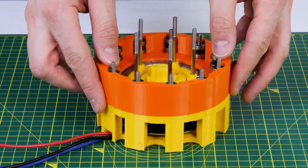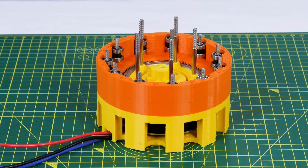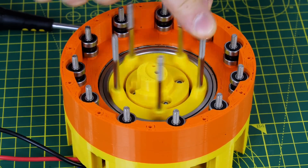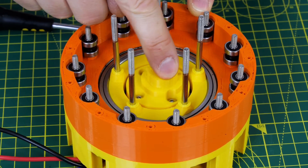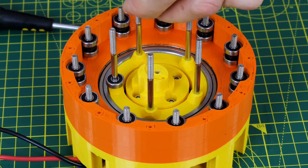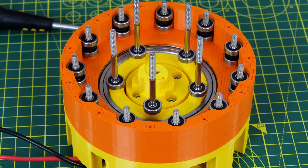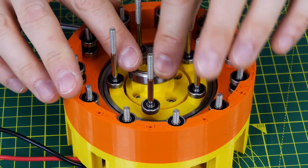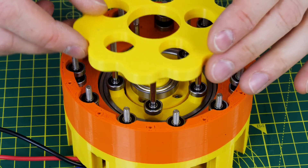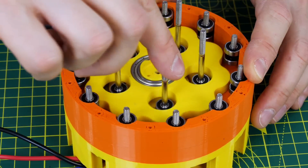That whole assembly fits on top of the motor mount so that the five output shafts turn independently from the cam on the motor. It looks like we've got the right clearance between the output shaft and the motor cam. Now we can continue to stack up the bearings on the center part. I'm using bearings the same size — 12 millimeters on the outside and a 4 millimeter internal diameter. We also have a bigger bearing on the camshaft this time, which is 20 millimeters internal and 30 millimeters external diameter.